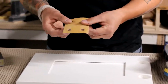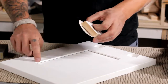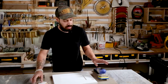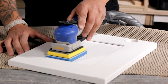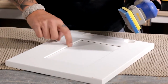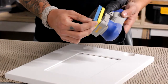So with the hand paper or even the block, when you start to sand on the inside here, you risk damaging or over-sanding this area here. With the Ecosilk Plus pad on the 3x4 sander, I'm able to get inside of these areas without damaging or even sanding at all the small section here, because the edge of the Ecosilk Plus pad is this kind of squishy foam.